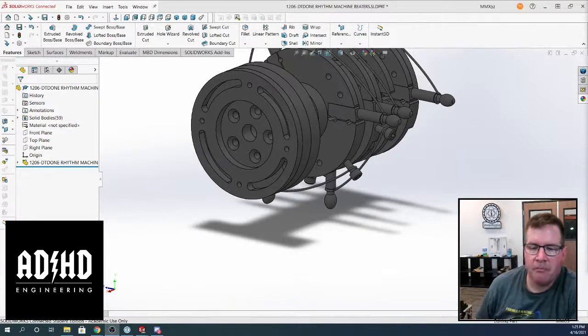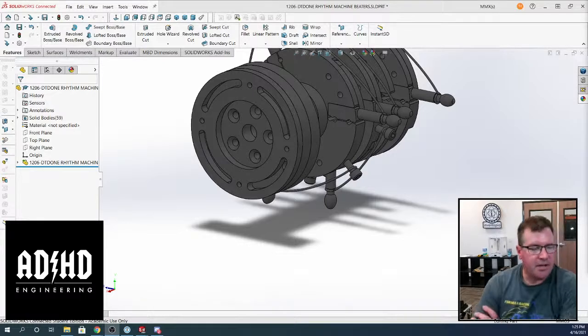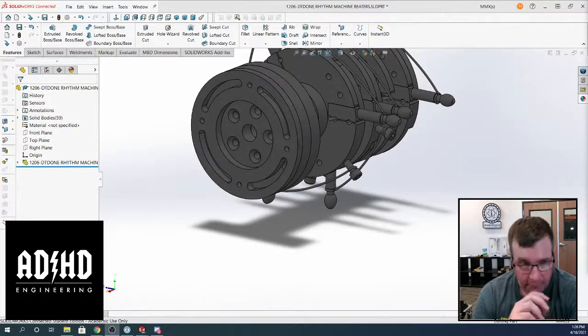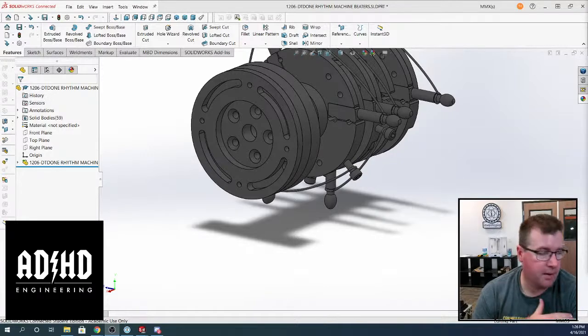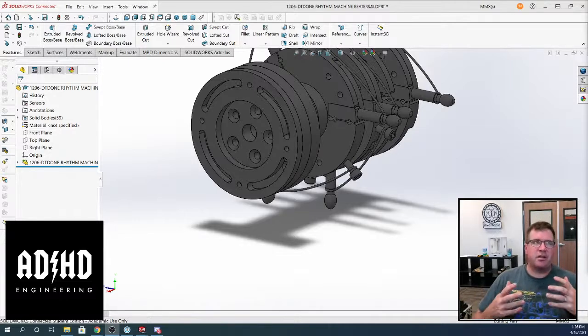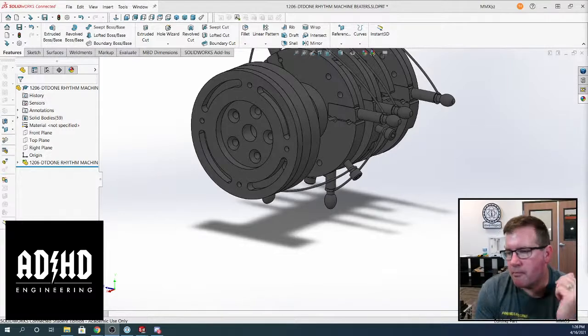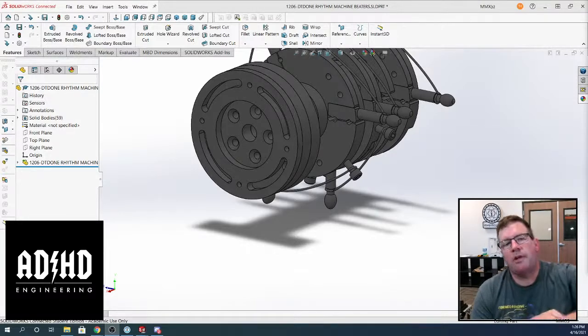PBS. Okay. Yeah, so the idea was we weren't really trying to design the frame as we were trying to create a really robust skeleton and the reference geometry that we can use to make the frame. Because the tempting thing to do is to start by building the frame and then hang things on that. But then if other components change, which means you would want to edit the frame, then you have dependency issues. So what you want is for the frame to morph to your parts.